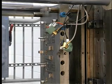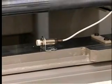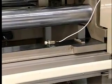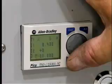You can mount up to four spray heads. Place the proximity sensor near the mold where it can magnetically detect the opening and closing of the mold. Lastly, test your settings and spray pattern and make adjustments as needed.